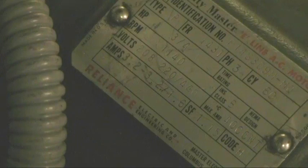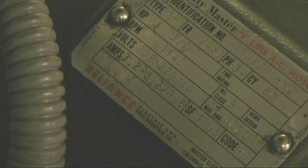If we use the formula V equals L times di over dt, then we must come to the conclusion that we've got less L, or there's fewer number of turns in there. And if you're thinking about that in the actual induction motor, you're saying, okay, but it's still got the same number of turns. Well, the way it's wired, we can run those turns in series or in parallel, and when they're in low voltage, they're in parallel basically.